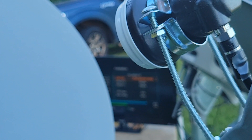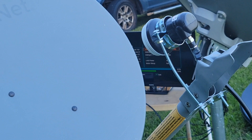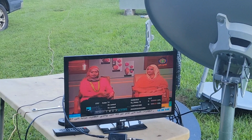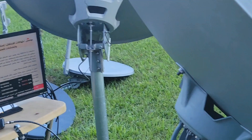In the future I need to get a longer bolt and go up higher so I can bring this up and down to make adjustments, which will also compensate for having to do this manually. For now I just want to get a little signal - you got the idea, you just play around with it and you can get a lot of ideas. I thought about putting two LNBs on this. Right now I'm sitting here - when you do this you always look for the longest, strongest satellite in the sky which is 97 West. I'm seeing all fours and getting about a 53 percent signal.